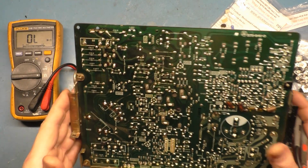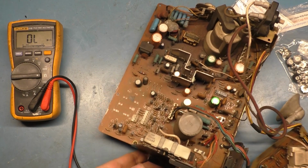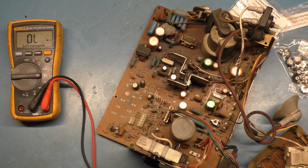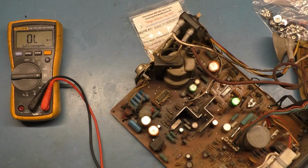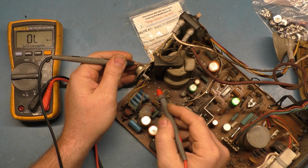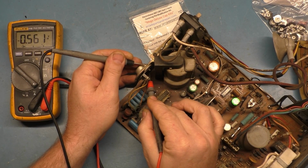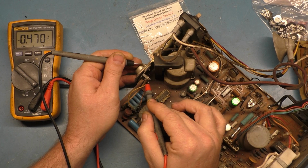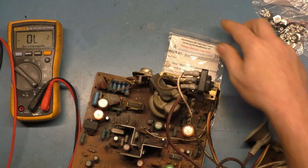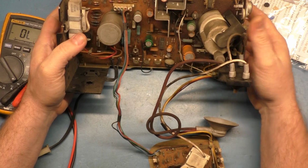Okay, well that's about all I need to check, except for I guess the HOT. We can check the HOT, but again, if the HOT was bad, I think you'd have other problems. So let's check the HOT. It's very simple, just like the voltage regulator. We'll put our negative lead in the screw head. We should get about a 0.45 voltage drop to each leg. So we go to one leg here, 0.47 actually, other leg, 0.47. HOT is fine.